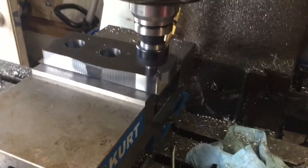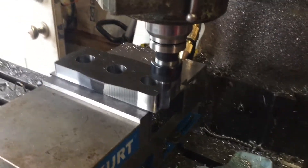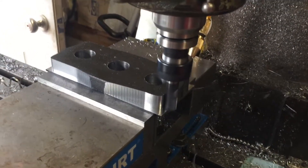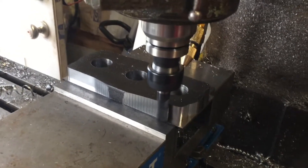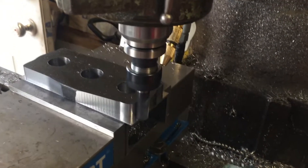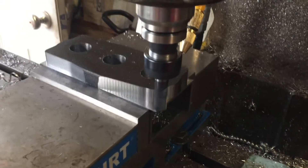One more thing about the CAM we've done. Brian's got it programmed so the Z is a little slower — basically 10 times slower. He's got it programmed to stay down all the time, and we're just moving back and forth, catching just a little bit, with the rapid speed at 180 inches a minute or as fast as it can get there.